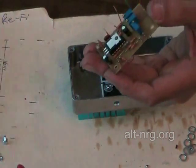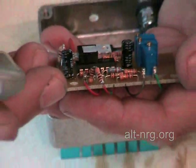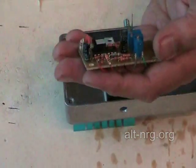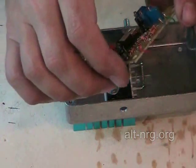I'm going to zoom in very close and show you what I've done to this board. You can see that I've piggybacked a second — I think it's R9 on the schematic diagram. So there are two 100 ohm resistors coming off the output of the operational amplifier, one to drive the gate of each power MOSFET, because there are now two in this particular build. I will eventually create a PC foil pattern that makes provision for the second resistor, but this is good enough for now for this particular run.